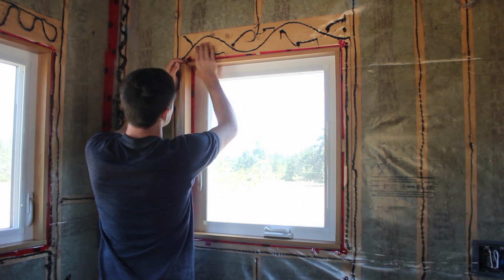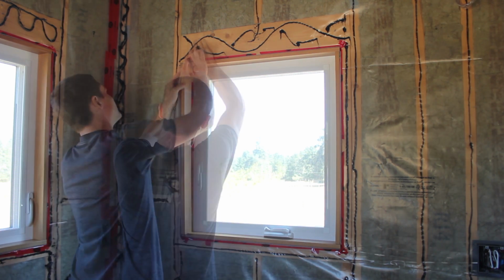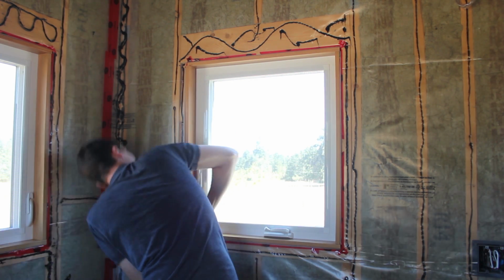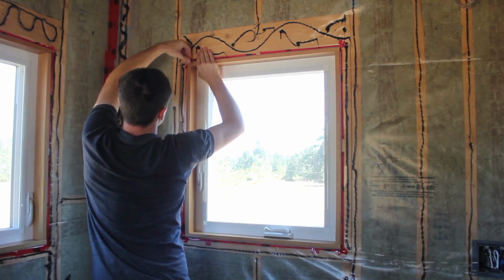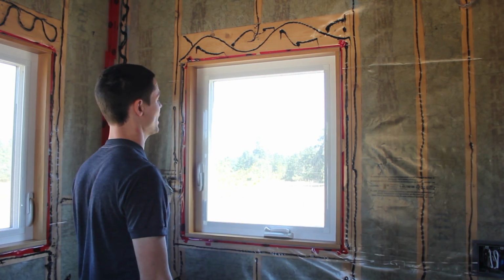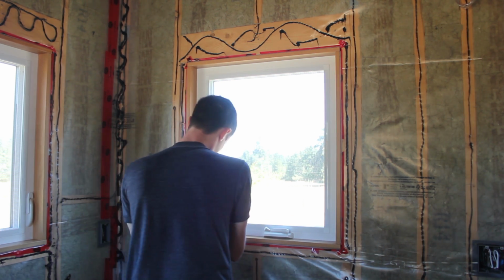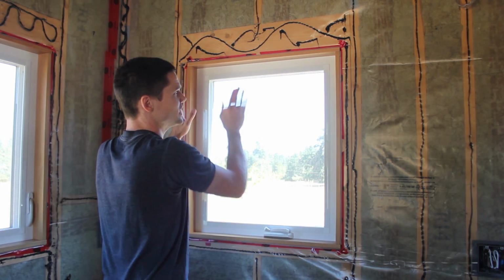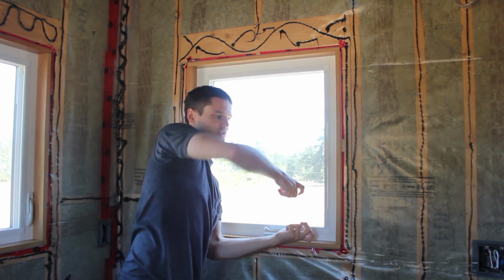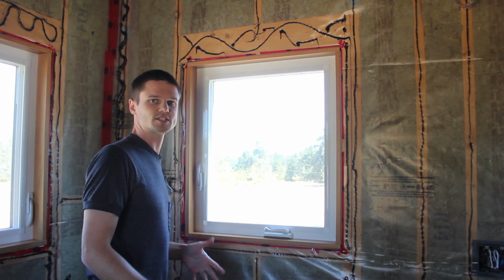So this one's actually particularly tight, so I'm just pushing against the pressure of the sill gasket and working the piece in, trying not to scratch, obviously, the finish that I put onto the pieces. Even without any nails, they're super tight, but that's good because it helps me tweak everything and creak it into position, and then I hardly even have to do much. I don't need 3 arms to hold the thing and line myself up and use the nail gun. I can just ram them in, and then the nail is just the finishing touch.